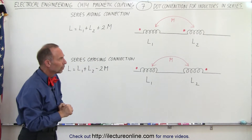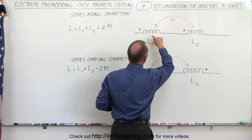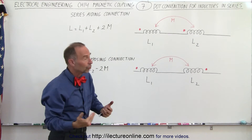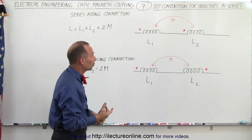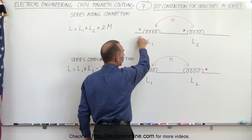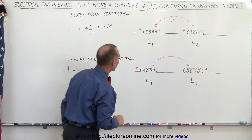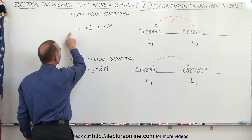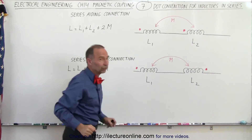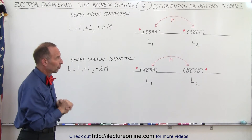What does that mean? Well, if they're connected in series and we have a current through the circuit, that means that current will affect both of these inductors. If there's a change in current it will also affect both inductors. In other words, we have self-inductance in each inductor because of the change in the current. The total inductance will be the sum of the self-inductance of the two inductors in series, because they will equally react to the change in the current through the circuit.